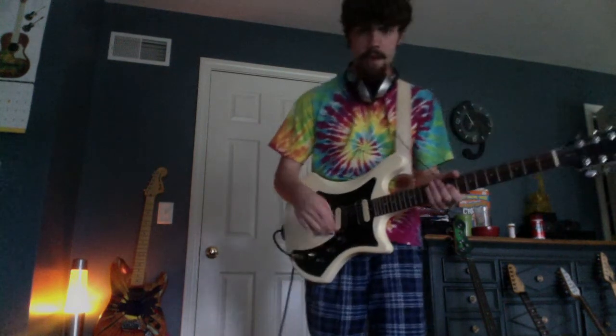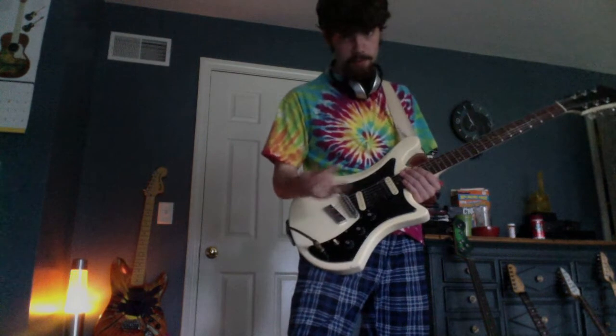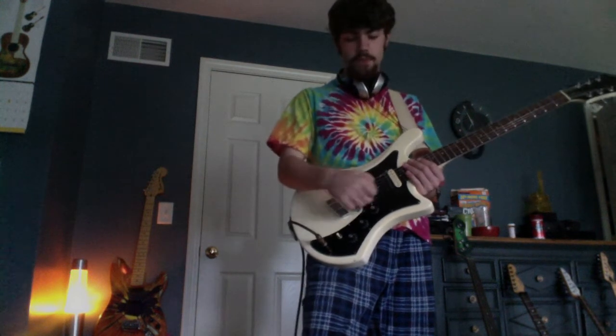Now, what might make this guitar sound a bit different from many of the guitars you've tried this on, this is just for anyone who's watching this video, the volume pot in here is, I believe, a 250K volume pot, as opposed to a 500K that you would normally use for humbuckers, because this guitar originally had two single coil pickups in it, but those have since been removed, but the pots were never changed. So now it's like two single coil-ish sounding pickups going into a 250K pot. That makes it sound kind of normal.